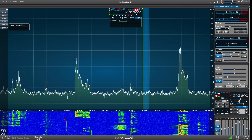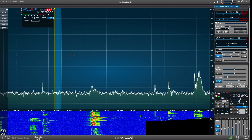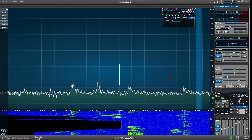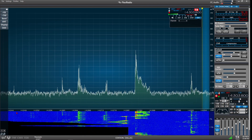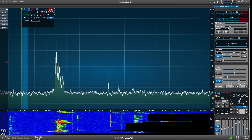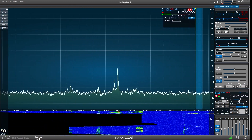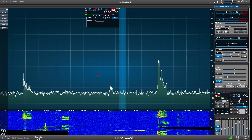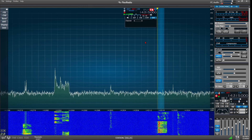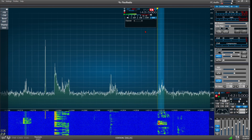Obviously this is our spectral display, and we have our signal waterfall. You can move around the display on a given band — we're in 20 meters here. Just by grabbing up here anywhere, I can move around and scroll the display over. So now I'm at 14304 on the high end of my display and 14244 on the lower end. That does not actually change my frequency — I'm just moving where 14304 sits on the display.